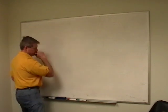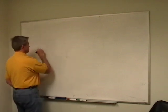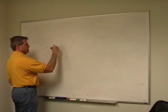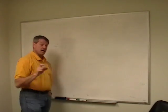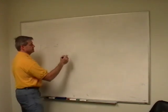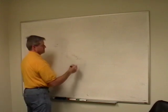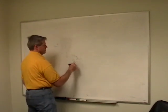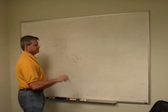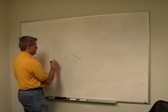The other thing we talked about, all those gates have capacitance, right? So when I look at my CCD device and I'm driving it from out here to drive those gates, there's some capacitance that I've got to drive in there with some R, we talked about that. But it's not small. You can get up to, on some of the devices I've seen, 2,000 picofarads, since nobody likes to use nanofarads, but if you want to call it nanofarads, 2 nanofarads. And a lot of these voltages we're talking about, they're not digital voltages. It's not 0 to 5. It's more like that low voltage is like minus 15, and the positive voltage is maybe plus 2 or plus 3. So you're talking about a 20 volt swing.